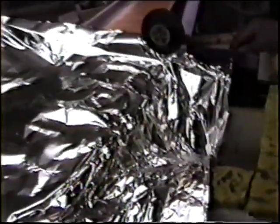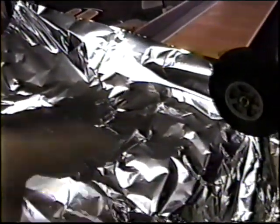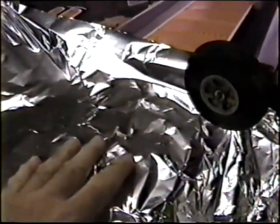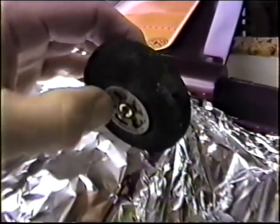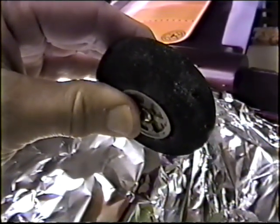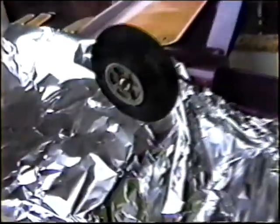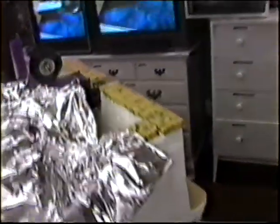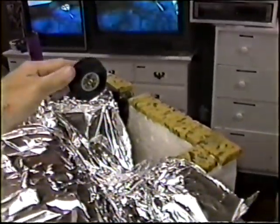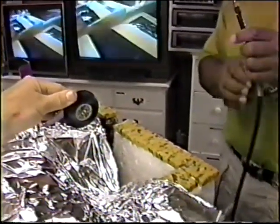Now, two things. We're going to have to trim this little bit of extra wire off here. To avoid having those hot little filings go flying off into the paint, you just lay a piece of tinfoil or newspaper there. I pressed the wheel up on a hub and backed it out maybe 5 thousandths, just a little bit. But I'd like to trim that wire flat so that hub can fit right over there. Okay, you got the tool with... This is that nice heavy parting tool. And I'll try to hold this, otherwise the thing wants to chatter. Just go slow.